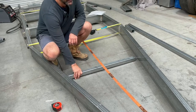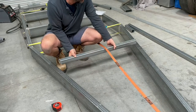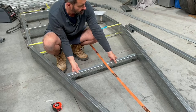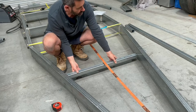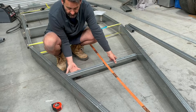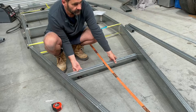Okay, well, you just saw me cutting this bit on a drop saw. It's actually the front line of the front wall. So the front wall sits down on this panel. Obviously, we're upside down, so this goes at the bottom, which is the top when it's the right way up. Now, I know from my SketchUp drawing that this is a certain length at its longest point, and I know that this drawbar should be right on 15 degrees. It's currently about 10 mil off 15 degrees.